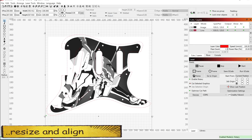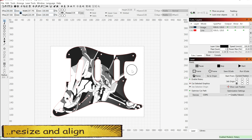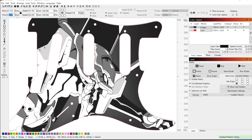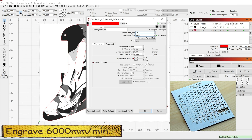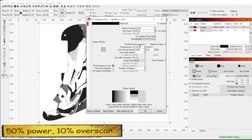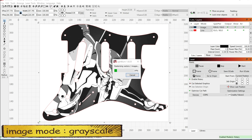The sizing issue is most likely because I screen-captured the image using macOS Command+Shift+3 — a quick and dirty way for PNG export. I've done material testing before, so I knew I needed to set the engraving parameters to 6,000 mm per minute, 50% power, air assist on, 10% overscan, and image mode set to grayscale.